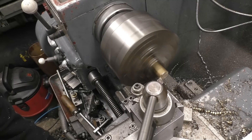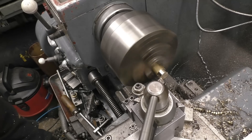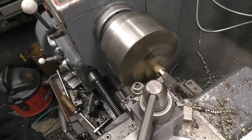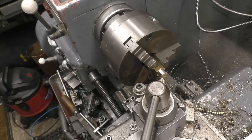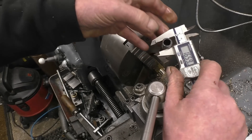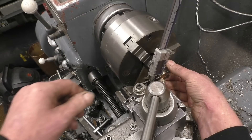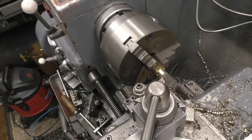16.5mm appears to be the diameter you want for 3/8 BSP. I've got a 3/8 BSP die. I'll just zero the vernier caliper on there and that gives me a direct reading of how much material there is to take off to get it down to size. I've only got about 0.12mm to take off, which is very little.